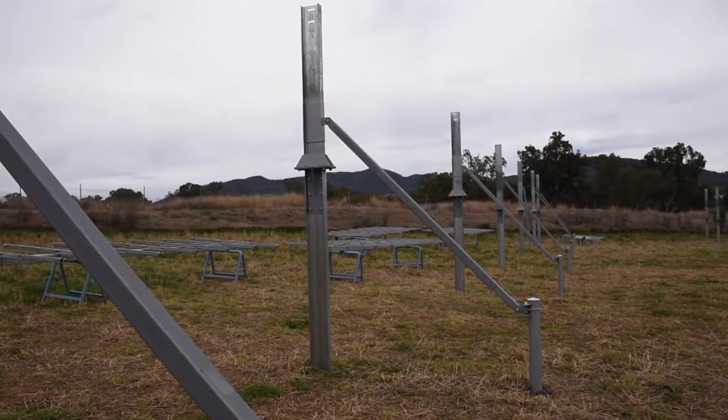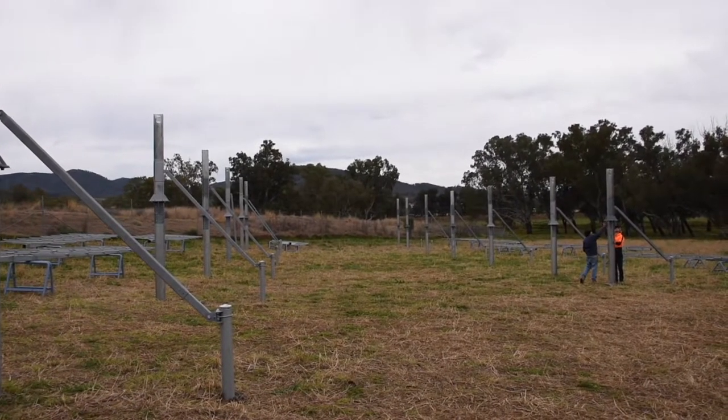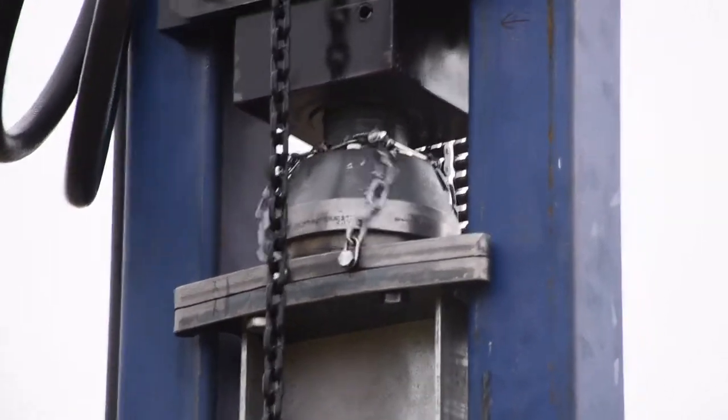So, now we can drive UB200s. Woohoo! What we're going to do now is look at the next solar farm and how we can make the whole process of standing the UB200s up, whether we'd go for an auto loader or a different way to do it. But the idea or the philosophy behind it is to get those posts exactly where we need them and make sure they're straight and in line and the right height, so the guys that are building it just come in and go boom, done. So that's, yeah, Walter's fencing, UB200 driver.